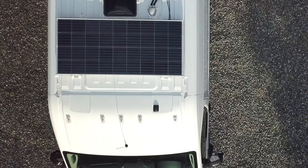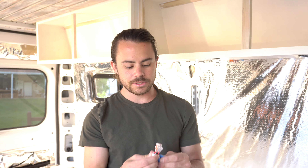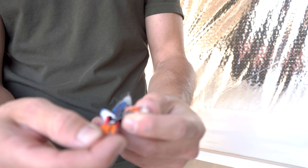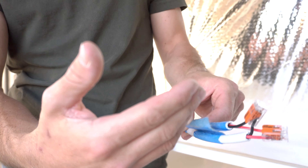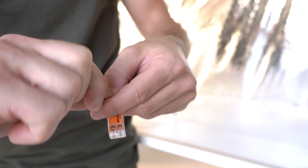A couple of maintenance tips for the solar panels: you want to keep them clean periodically — just climb up there and wipe them down with a wet rag to get maximum solar power to charge your batteries. Before building the structures, walls, and cabinets, I started running the wiring. For example, this is the 12-volt wiring — one of my favorites because it comes in a protective layer with the red and black separated, which is very convenient at the install location. For 12-volt systems, you're going to usually use a low-voltage braided copper wire — it's not solid; it has a bunch of little braids, which makes it great for mostly 12-volt systems.